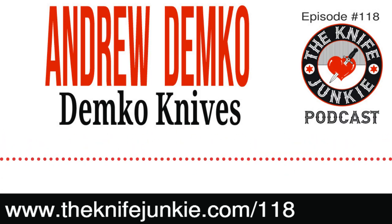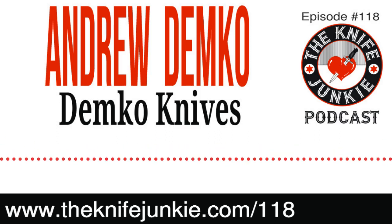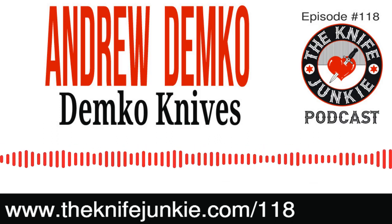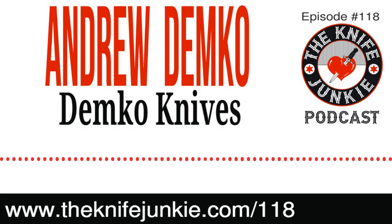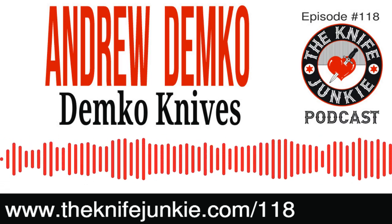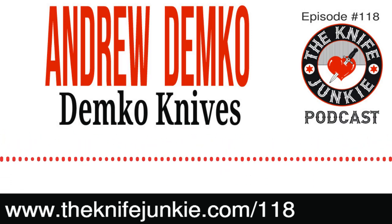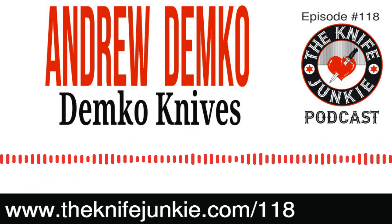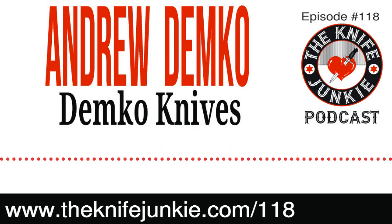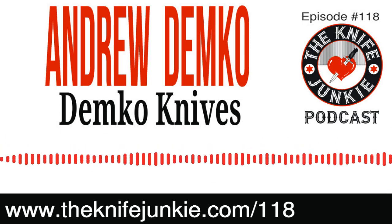I knew I could take that triad lock concept because the good thing was the stop pin — you take a lockback, add that stop pin, and it's already better. The stop pin is added between the spring and the blade itself and absorbs a lot of the pressure. As I studied lockbacks, I knew they started off pretty good but sometimes the rocker would sink in. There's no angle that allows for take-up — the rocker bottoms out and might not come out, but it's wobbly. I thought, if I put the stop pin in like a frame lock, I could make that lockback better.